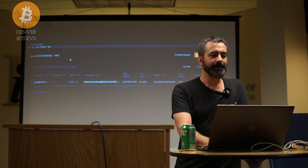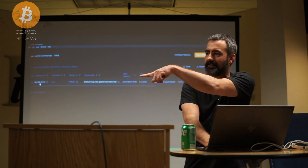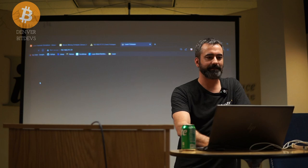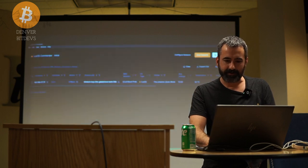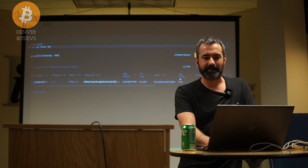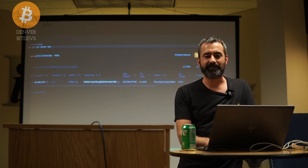All right. So yeah, I did a network scan. It found the miner running there through my phone hotspot. If I click on that link, it pulls it right up in my browser. Here's the LuxOS GUI. If I go back to Commander real quick, I can see the profile it's running, voltage, temperatures, frequency. It's at 225 megahertz right now.